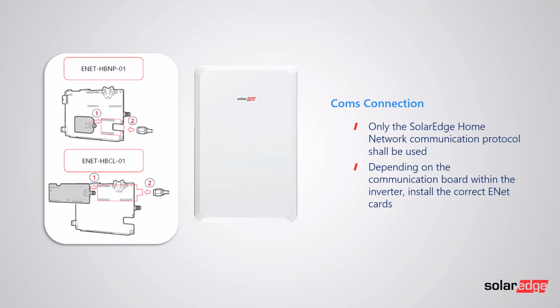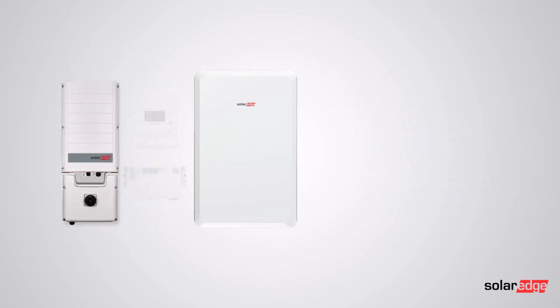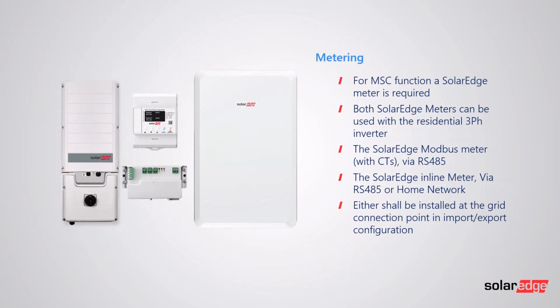What's ideal is if you're going to do an installation on an existing system, because you may not know what type of board is in the inverter, just take both of the cards with you. The inverter, as it's now got a battery, has to have a meter installed, so you can use either the Modbus meter or our inline meter. Ensure that it's set up in import-export configuration and connected at the main incoming supply.